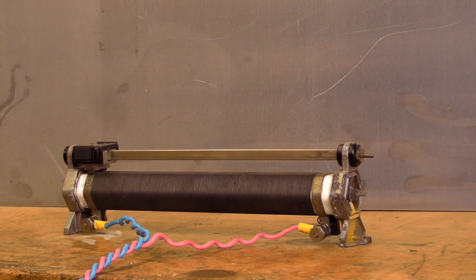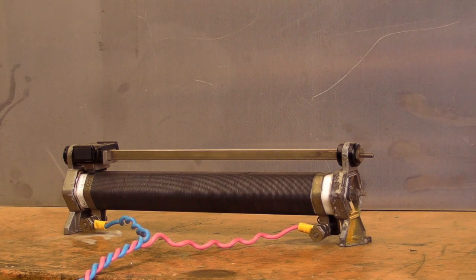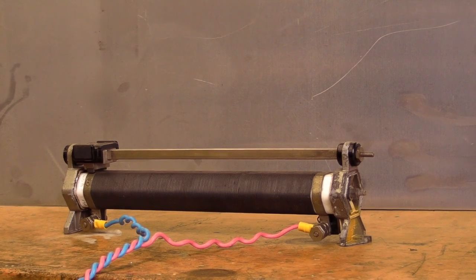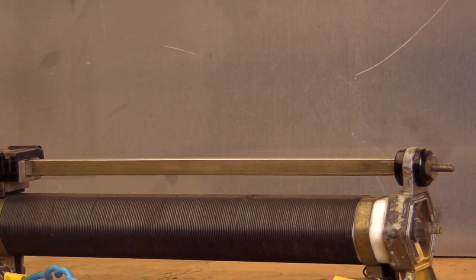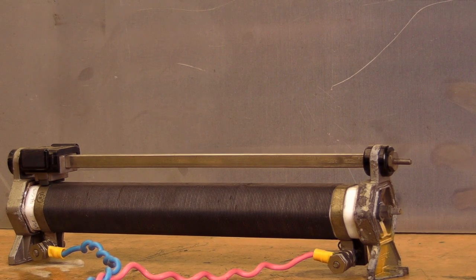We're running at 200 joules at the moment. Our poor little dummy resistor is made with some resistance wire other than nichrome. Near as I can figure there's no insulation between each of the windings on that wire-wound resistor — it relies on an oxide coating on the wire itself. At 200 joules we just get occasional breakdown between windings in pretty consistent positions. As the resistor heats, the insulation breaks down further and we get more and more sparking at a variety of locations. Let's push the envelope a little bit, let's go to 400 joules.